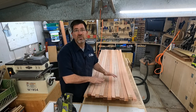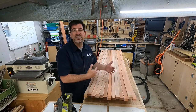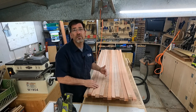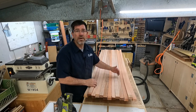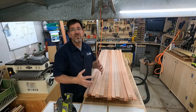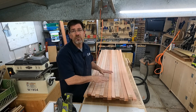All my redwood boards are now cut to rough profile, and I've got a variety of shades of wood — some are tighter grain, some are looser grain. What I need to do now is take these and arrange them in a pattern that's going to look good on a finished board. I'm also going to intersperse some other types of wood, maybe some maple. I want to put some stripes and things that will give an interesting look both to the board and to the section where the guitar is going to get cut out, so I have to start thinking in terms of design of both of those elements as I arrange these boards.